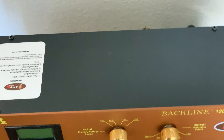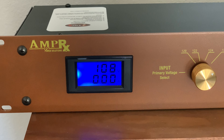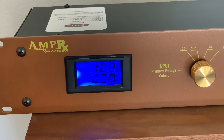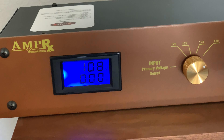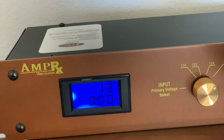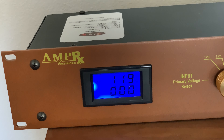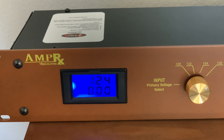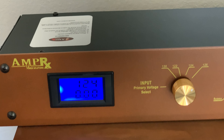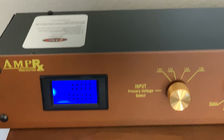It works as advertised. I have nothing plugged into it right now, but I'll flip it on so you can see the display — it's really bright. Right now it's saying 108 volts in reduced mode, which seems like a lot. In bypass, it reads 124 volts coming out, and if we reduce that 10%, that's 12.4 volts reduction. Clearly something is not accurate because it's showing a 16 volt reduction.